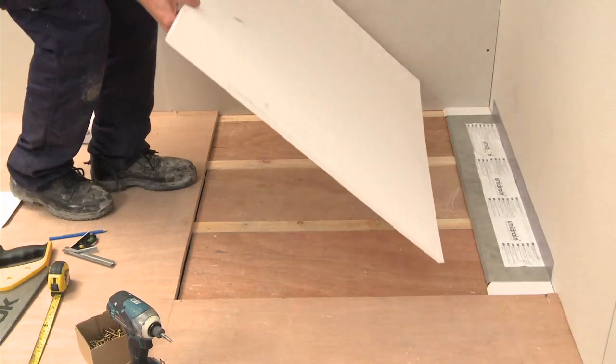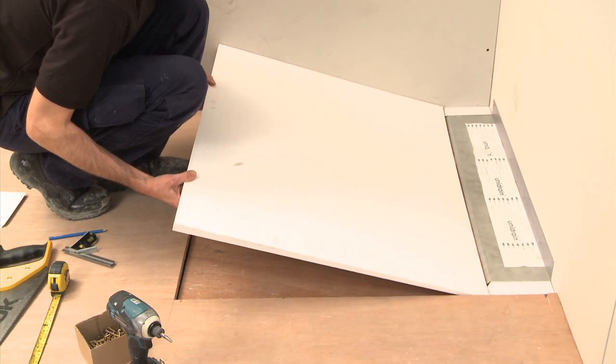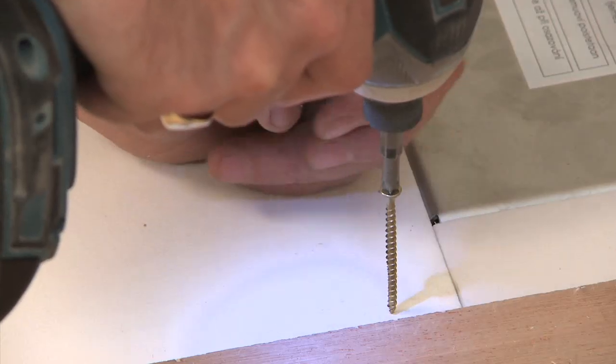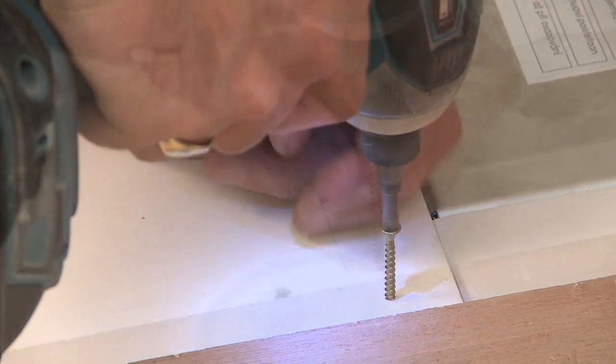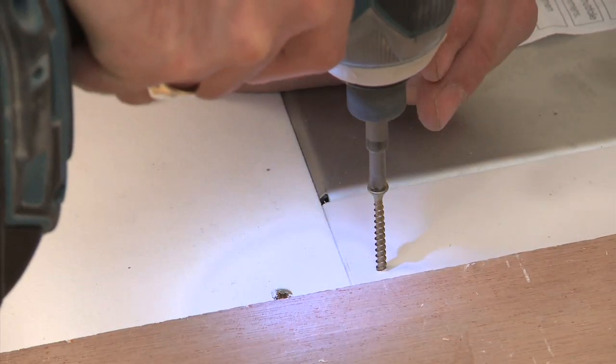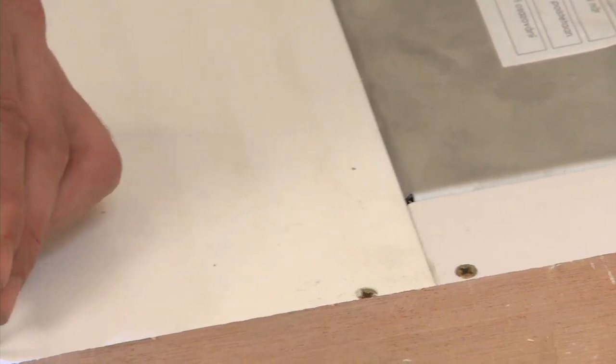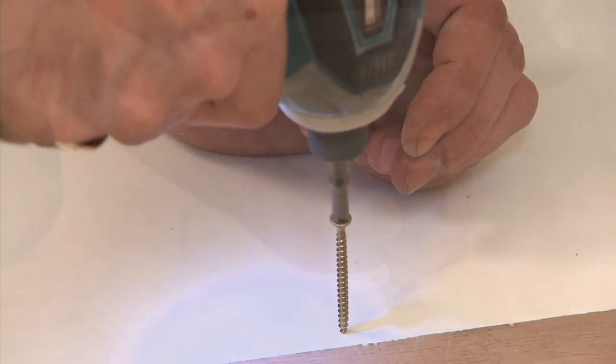Place the UniSlope board onto the subbase. The board should fit flush against the drain unit, end fillers and surrounding floor. Secure both the UniSlope board and the end fillers into position using drywall screws. We recommend 150 mm between each screw head.